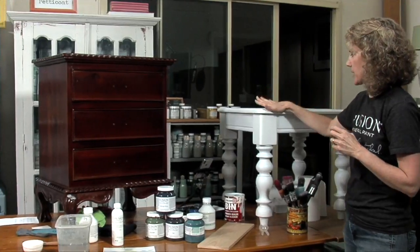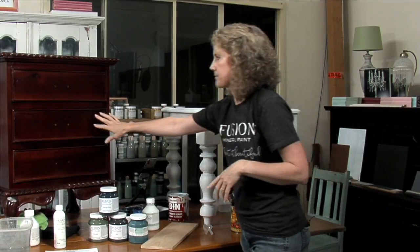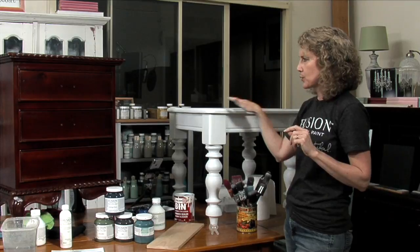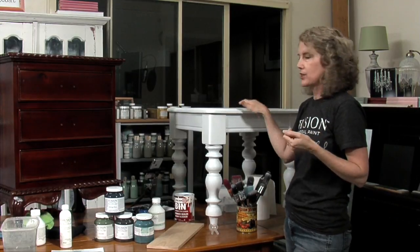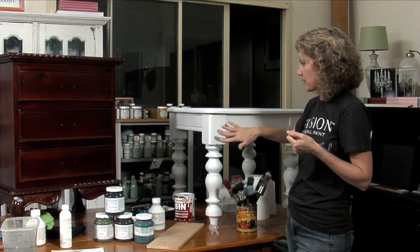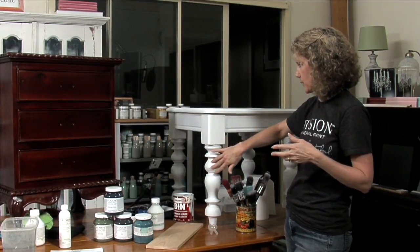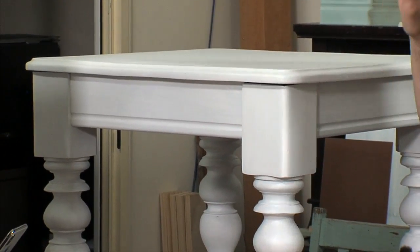Sometimes you'll get wood knots that will bleed through as well. I use the white version because I'm transitioning to a lighter colour, and I actually save on some of my Fusion paint. I wanted to show you this example here where I used a white colour — this piece had very similar tones and a very shiny lacquer finish. To be sure, I added a bit of UltraGrip. My reasoning was that if I sanded too much to get grip, it might allow the stain to come through. So instead of heavy sanding, I used UltraGrip and then painted white over the top — about three coats of Fusion's casement colour, one of the whiter whites.